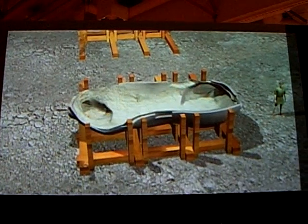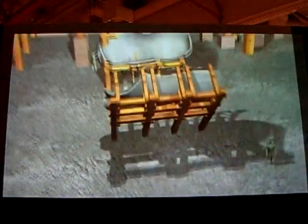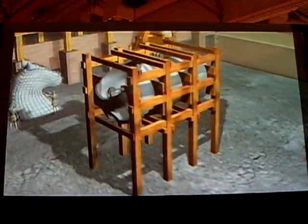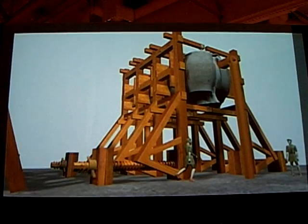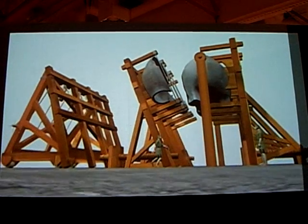Subsequently, the layers of clay most external to the casting core are applied. The ribs that make up the internal reinforcement are applied. The two halves are closed and fastened by specially designed cross pieces and bolts. The core is thickened still further from the inside and is left hollow at this stage to facilitate transport.